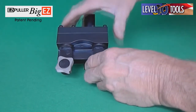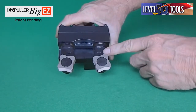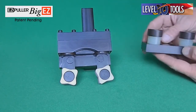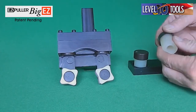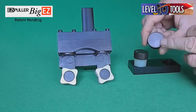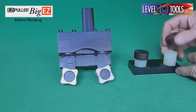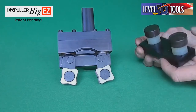As you can see, these grippers provide a very strong force for holding the material. That force is generated with a urethane spring that is backed up by hardened steel lifters. The lifter is actuated by the cam action of these hardened steel arms. I have removed the cover of the tool to show the urethane springs and the lifters. As you can see, these springs are very tough — they are a 95A durometer and they are much stronger than die springs of the same size.